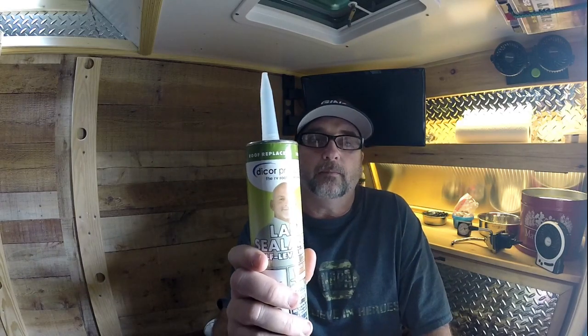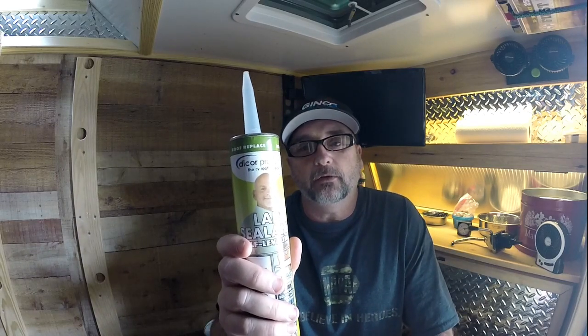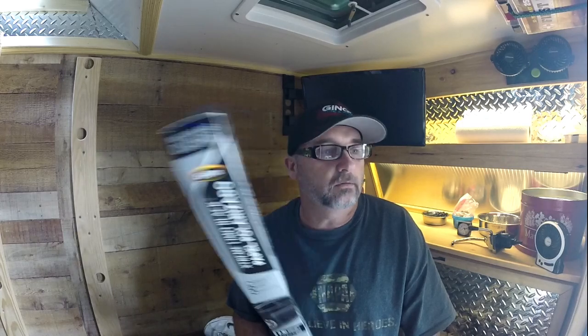As you saw in the video, there was just wire hanging there because I needed one more light — I'll get that done today. This stuff right here for all the lap joints on top where the vent is — I'm going to squirt it all around the edges and around all the screws. This Dicor self-leveling stuff is the best for that on the roof. I also have some window tint for the windows because it became an oven in here even in the cold weather when the sun was shining in those windows. We're going to tint the windows, we're going to make some curtains — probably not today. I'm going to do the light today, check out the bearings, and probably do the Dicor today. I noticed a couple areas on the coating where I could go back over with a fifth coat of the smooth just to seal it a little bit better.